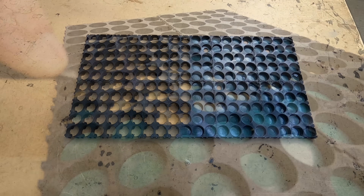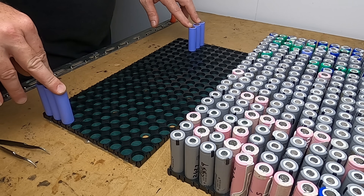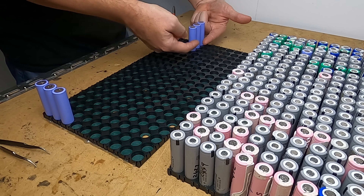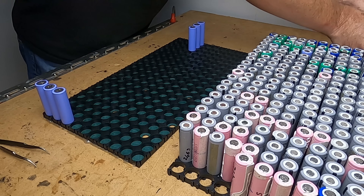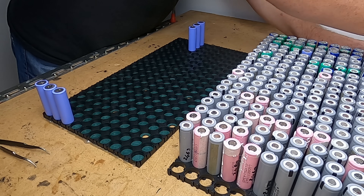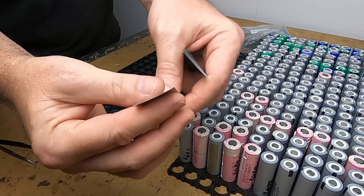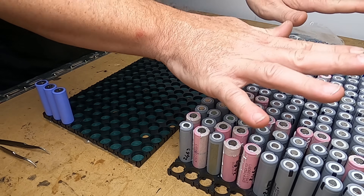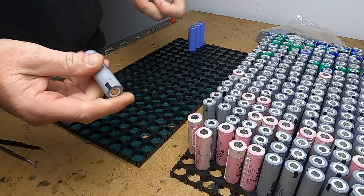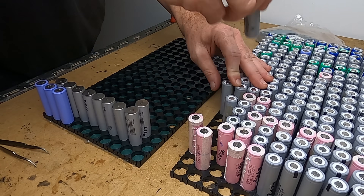Placing new insulator rings on the positive terminal gives an extra layer of protection once the fused nickel sheets have been installed. Building out the first battery, we need to put six blank cells — zero volt cells — in here; the blue color indicates they won't be connected. We also need to remove nine cells to allow room for the holder. We take them from the bottom row, as those are the lowest amp hour cells, and set them aside. We'll be re-shrinking anything that isn't gray, putting new heat-shrunk cells around the outside and the gray originals on the inside.